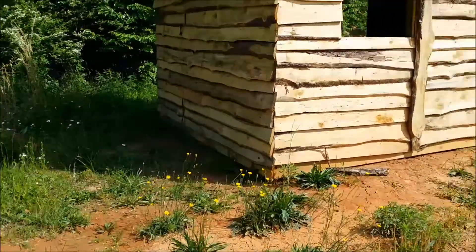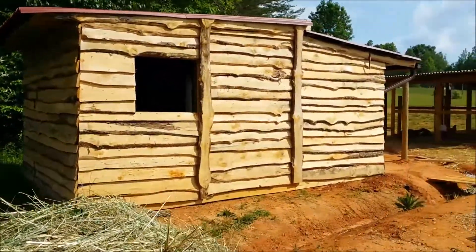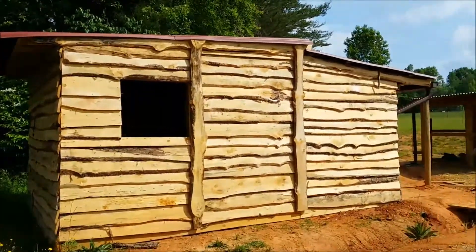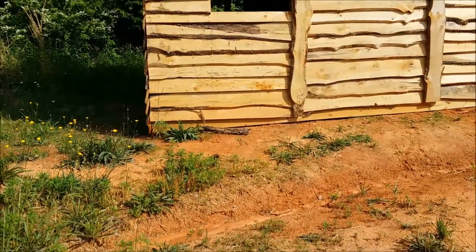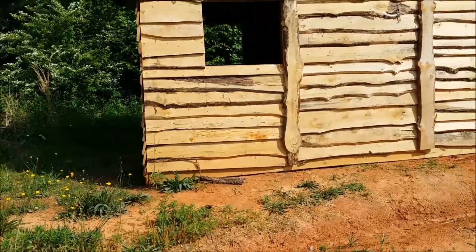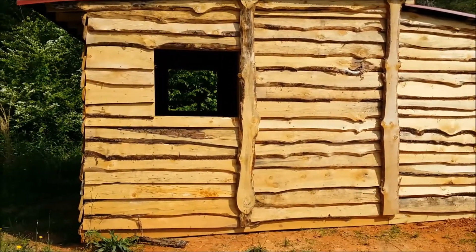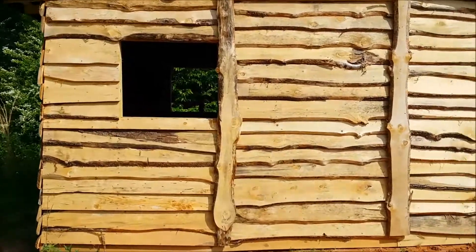I'll step away a little bit so you can see. There's one of the sides where the seams showed up — I used some boards and ran them vertically, and everything else is horizontal. On the bottom I have one board that's treated that has contact with the ground, so I won't have any problem there. I'm going to put a preservative on here, like a Thompson's preservative, using a spray bottle, to keep the borer bees out and to preserve the wood so it doesn't get a dark look to it.